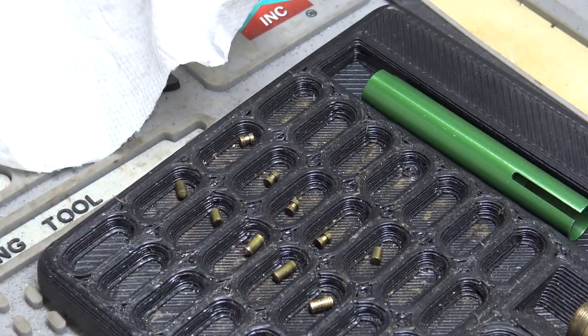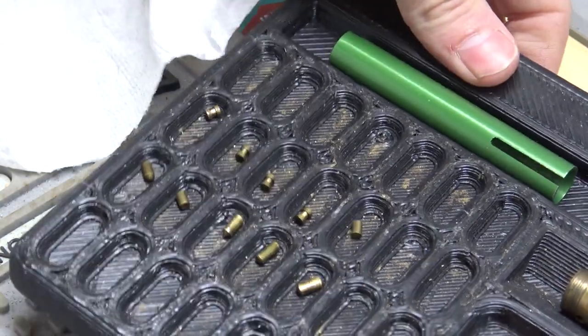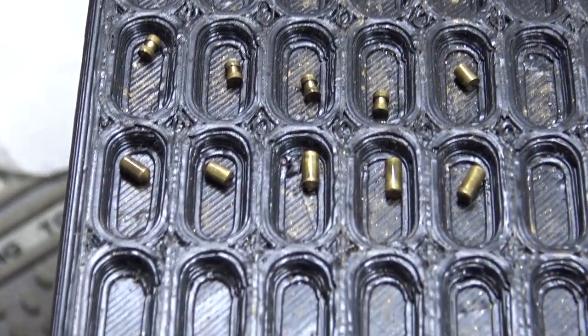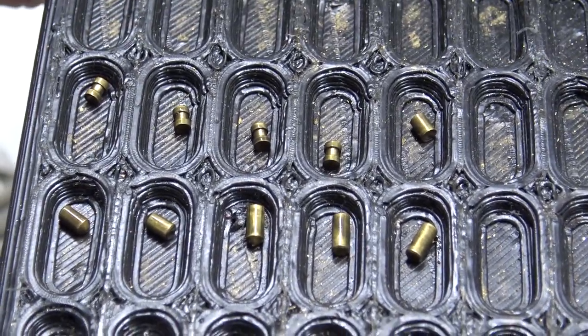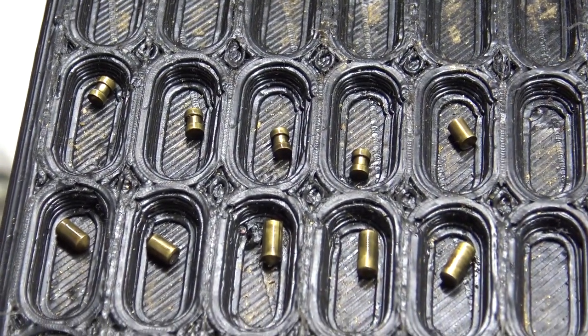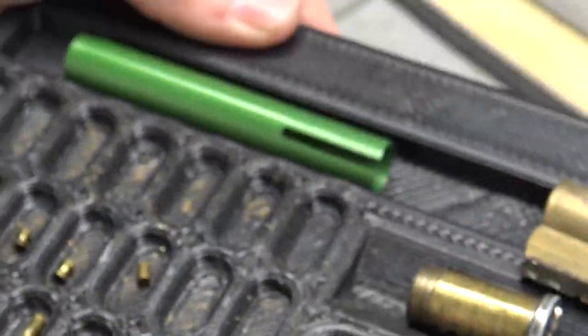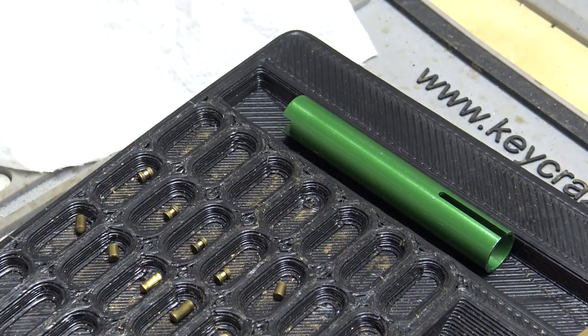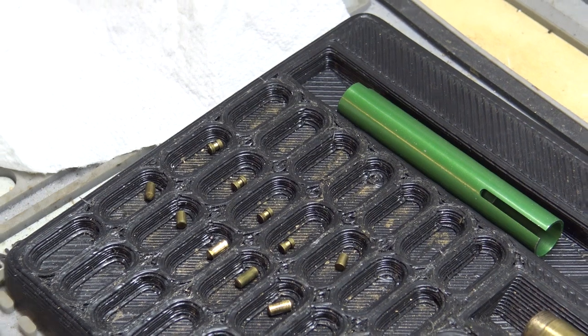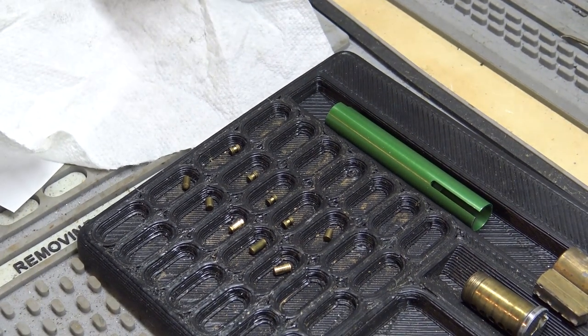Four spool pins — that's what you normally see in an actual Schlage. This is a Schlage brand cylinder I pulled out of a deadbolt on a business several months ago and set it aside. So four spools and a standard. Since I decoded it, let me go cut a key and we'll see if the bitting is right on it.